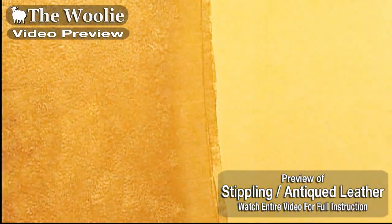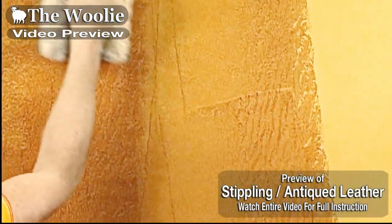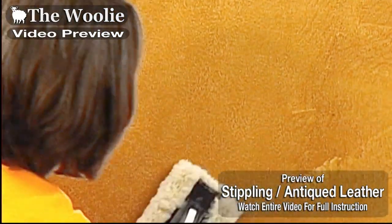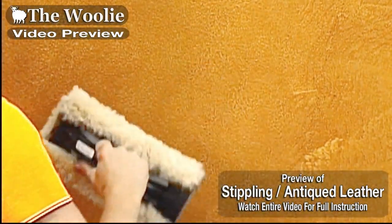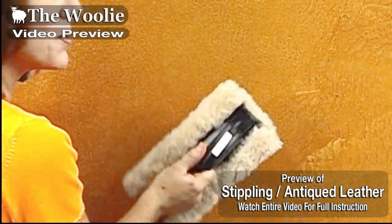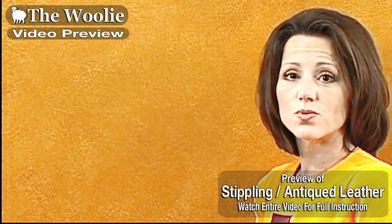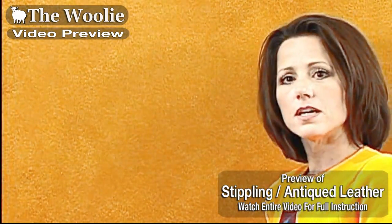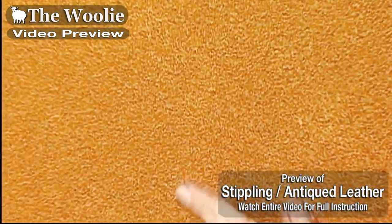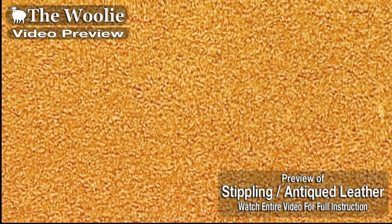Amber is going to go ahead and add more glaze, and I'll follow behind her — it goes really quickly. I'm taking the harsh line and tapping it away down to nothing. I don't need to rotate the woolly because it really doesn't leave an impression. It also doesn't matter if I hit it hard or light, though light is probably a better idea. This is an extremely subtle and elegant technique. We'll zoom in so you can see what it really looks like up close — see how the glaze gets broken through the color, and you can see the little jabs. That's what stippling should look like.